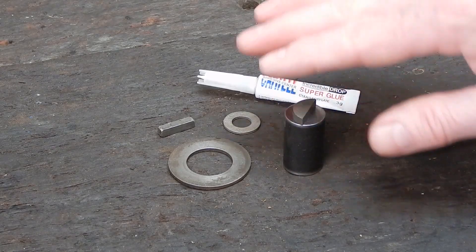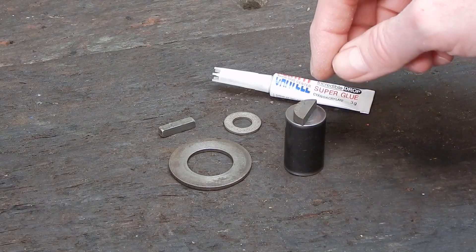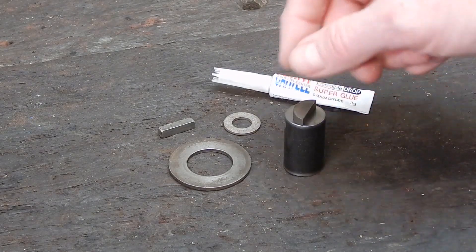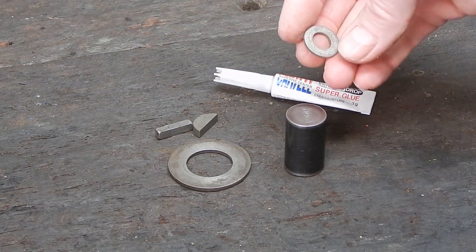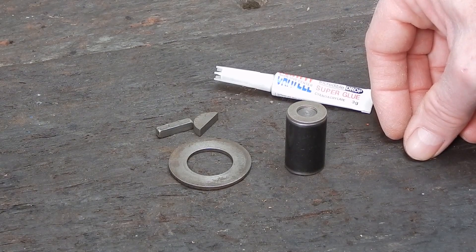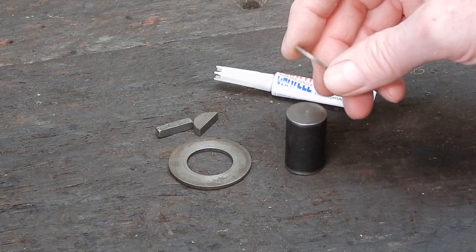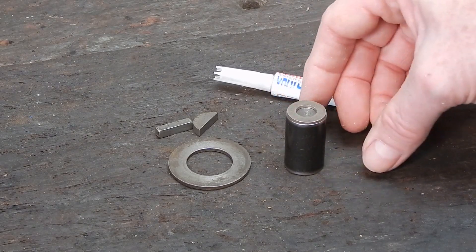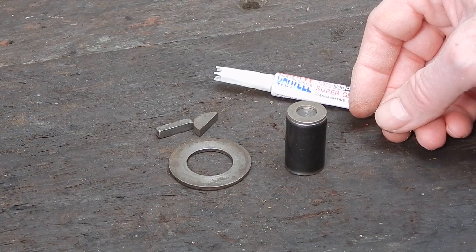If it was a woodruff key you'd be grinding that back for sure — you can't machine a woodruff key. This glue is strong but it's not strong enough that you could use carbide on it; it would tear it off. So you would have to use a little tool post grinder, or even an air die grinder if you haven't got a tool post grinder, and put a bit of water on it occasionally to keep it cool and grind it back. In this case I'm not going to use one of my good woodruff keys — I'll just use a washer and reduce it back. I'll do it with my little air die grinder just to show you how good these little air die grinders are and how accurate they can get stuff. You would actually also be able to face that off with a small high speed steel cutter if you took it very gently. The super glue would be good enough to hold it for that exercise, but ideally use a little air die grinder. So we'll move on and I'll get it set up.